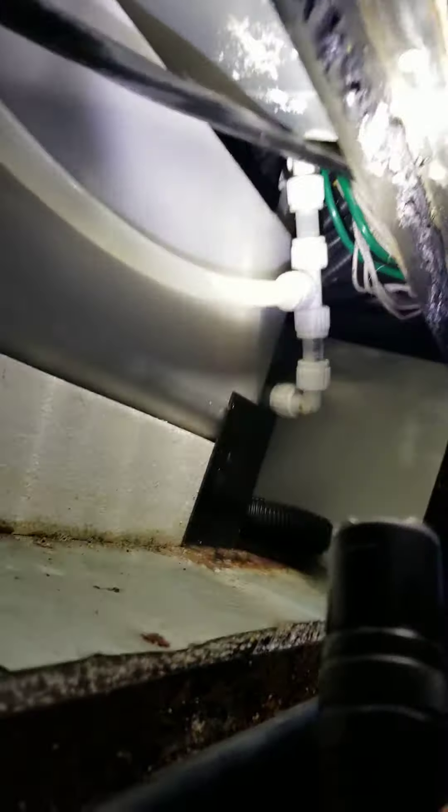Once you go through there, come right around here — you'll see there's a hole right there. Push it up through, and that's where it goes underneath your kitchen cabinets. You go up behind all the drawers. You can pull out all your bottom drawers — back there is a fuse panel. That's the 6/3 wire, and it just snakes back behind the cabinets underneath the drawers.